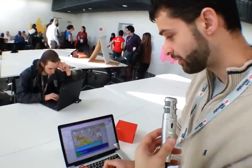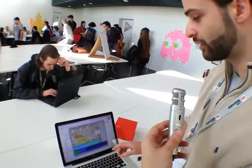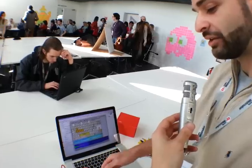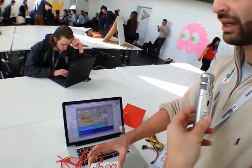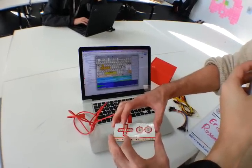And now when I connect any of these pads on the front to Earth, I can get it to press a key on the keyboard. If I press the up arrow, it's making a little sound. But if I connect the Earth to my body and then the up arrow to my body, I can get the same sound — it's just the same as pressing the arrow key on my computer.